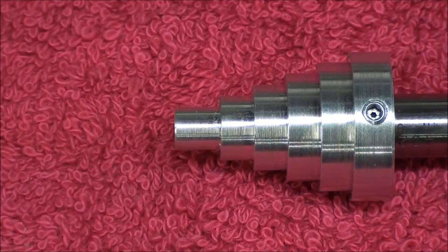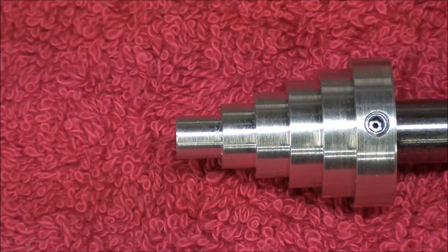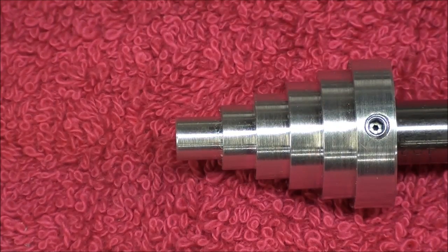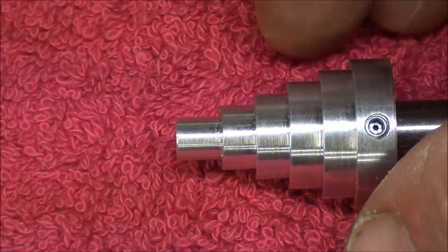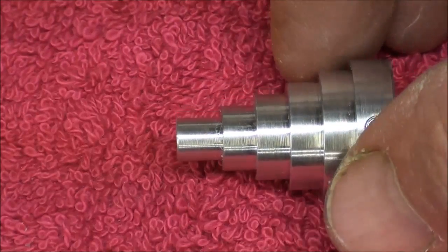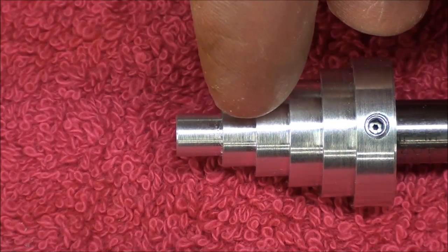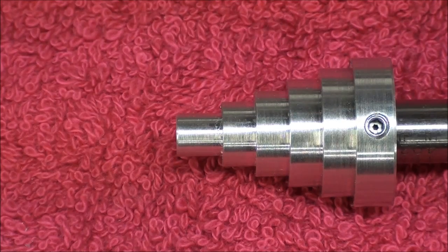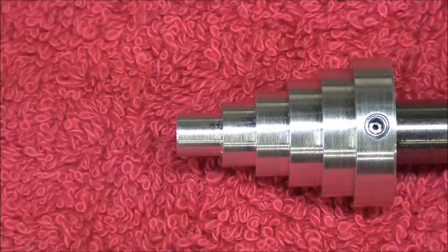Let's step over to the lathe and watch the different operations I'm performing, the order of operations, and why I'm making these various cuts. There will be a tolerance here — you'd like to get these right on, and this is a good turning exercise for you beginners. This could be made of aluminum or steel. Mine is aluminum, but you can be one, two, or three thousandths over or under and it's still going to fit into the collet. Should you go under several thousandths on any one of these, rather than scrap it, you can probably live with that, and the collet will still hold that diameter.